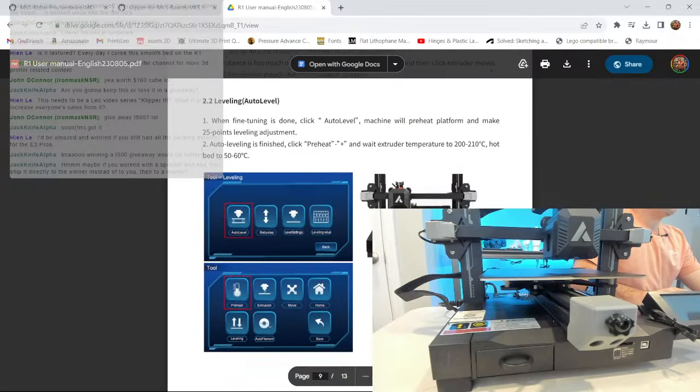Sorry. Make menuconfig. All right, so here we go. We're already set up. Flash an image. This is exactly how I want it. STM32, F103. Bootloader 28KiB, and it was USART 3, PB11, PB10. So after make, right?